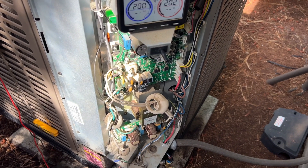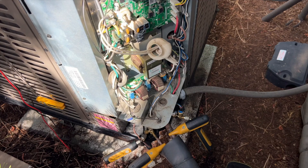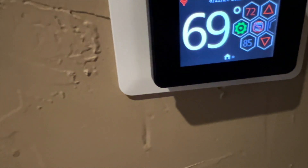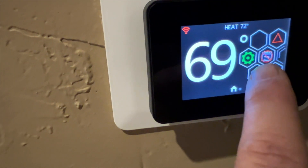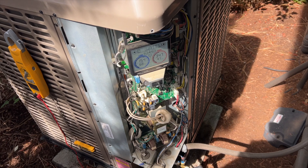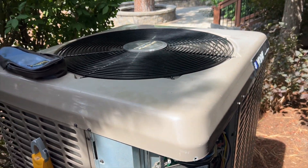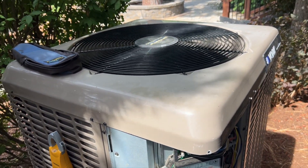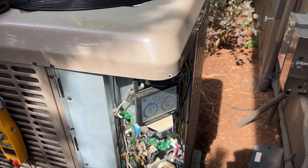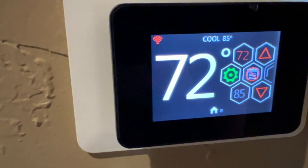So I stepped away — got tired of waiting for it. Now it's telling me emergency heat's being called for, so I wonder if I still got that error code. Suction pressure's at 200, but the compressor never kicked on — no error code. I think I might've just turned the temperature up too high so it kicked into second stage. I set the set point two degrees above room temp. It's been running now for a little while. Let's go make sure we don't have an error code. It looks like we don't have that error code anymore. I think we're good to go.